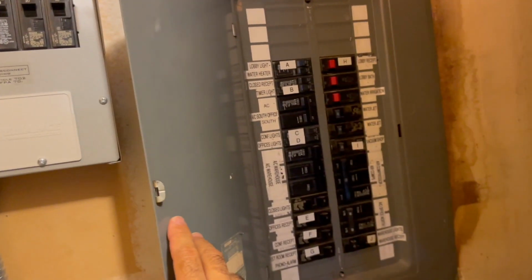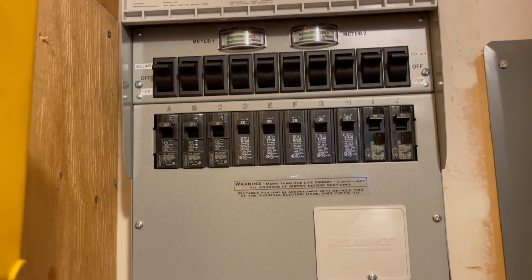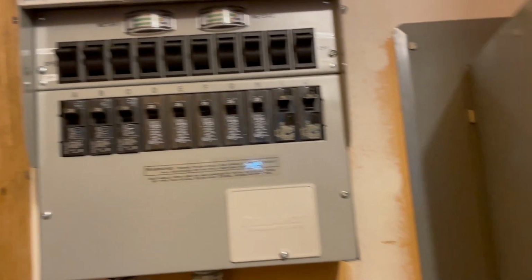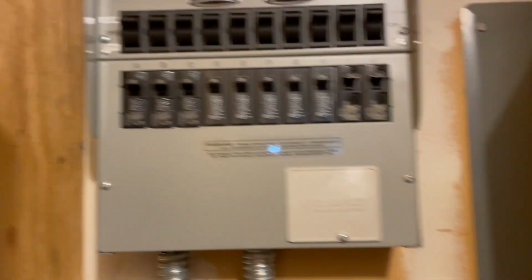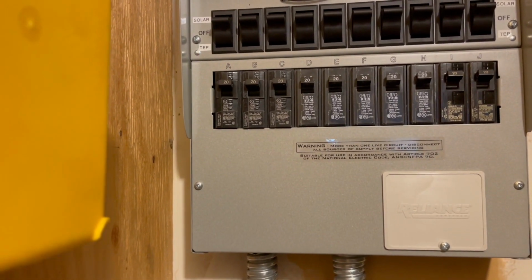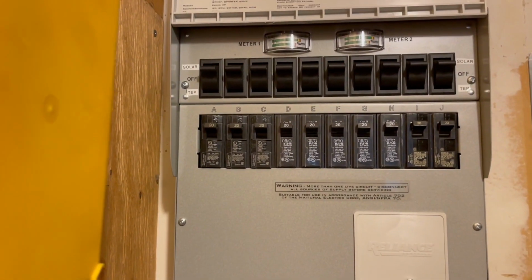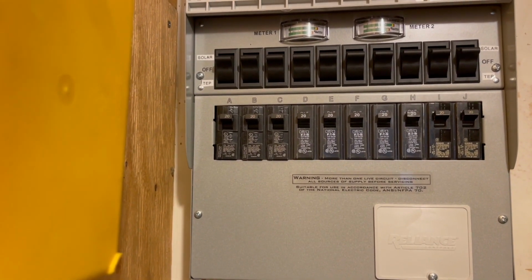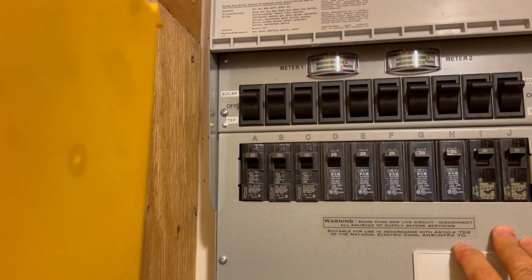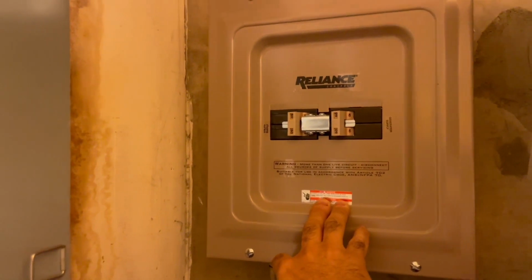And then this is the breaker panel. So basically, yeah, I'm sure you could watch videos on this ProTrans and you'll see how it wires in, but it's connecting to the load, getting its input from a circuit breaker and then sending it to the load, and then the circuit breaker is the input from the utility company, and then on the other side you've got connections that are going to that off-grid panel that I have that give the AC feed to this. So this is doing all our office loads, and then this is doing one air conditioner. So we have about a 4 kW air conditioner that we're able to power from this unit.